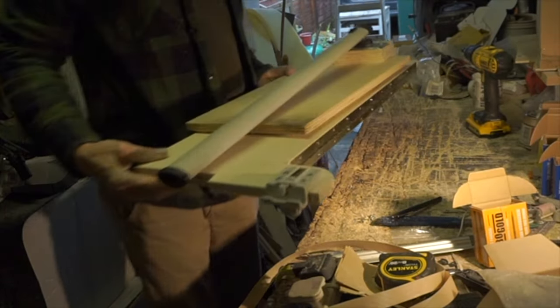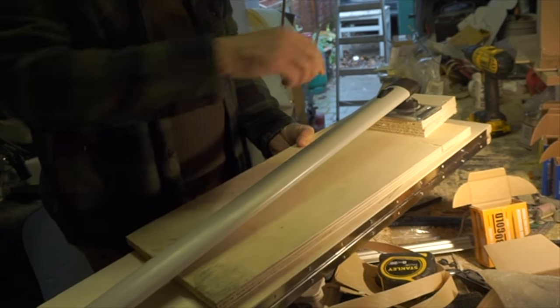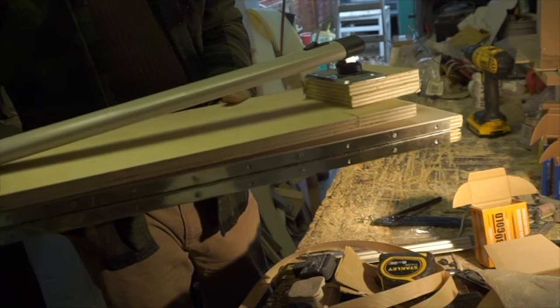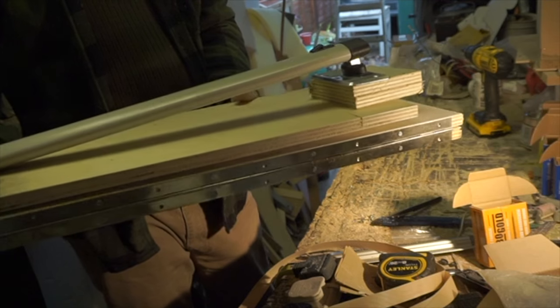That appears to have worked, so I've just cut this down. That's the folding leg, which is going to have to be mounted to two blocks to bring the tabletop up to dining level. And then the swivel plate works quite well, so I'm just going to cut the wood around some corners, then take it apart and laminate it with Formica and do the edging.